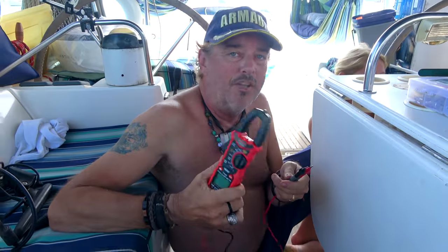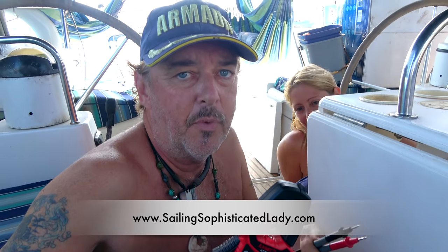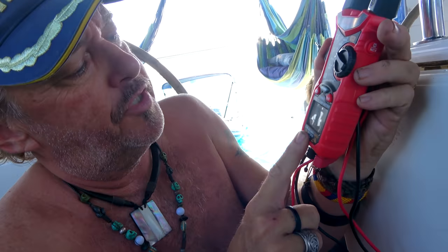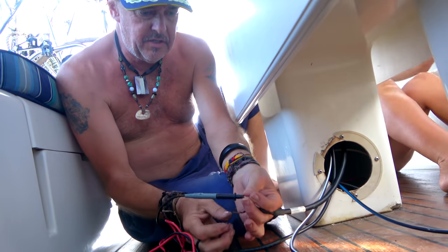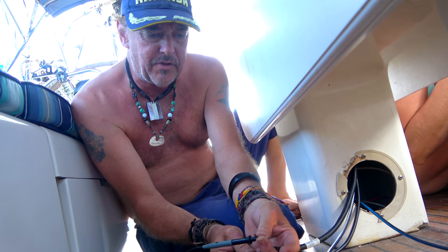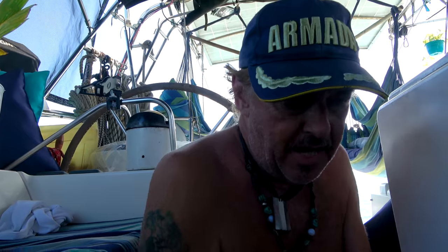It's good for checking your alternators — you can clamp right onto the alternator and see how much amperage it's drawing, making sure it's doing what it's supposed to. It comes with a very good assortment of leads for different purposes. We're going to have a specific web page set up on our website for all the stuff that we use and recommend on the boat. Basically, I just switched it to DC voltage, connect this to negative, this to positive — and there you can see we've got 13.03 volts. We have good live voltage coming through, no resistance, no problems.